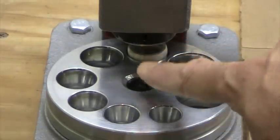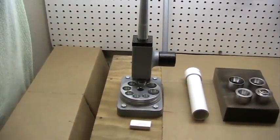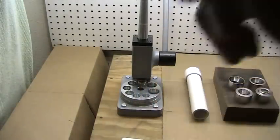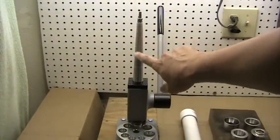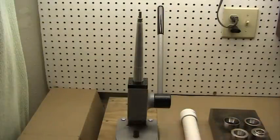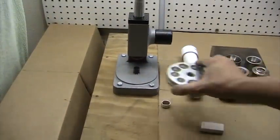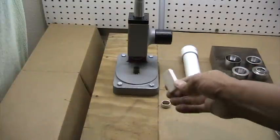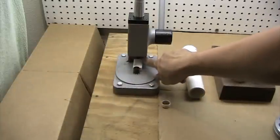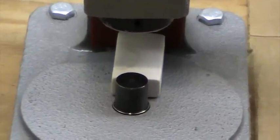I find that tape really works well. The next topic I want to bring up is the eraser. What I found when I'm expanding coins on the expanding mandrel — particularly with larger size coins like the Morgan silver dollar, the Peace Dollar, and especially the American Silver Eagle — is I take out the reduction plate, take my eraser, and actually just stick it in between the pin and the bottom backside end of the ring sizing machine, so you can get a good idea of what that looks like.